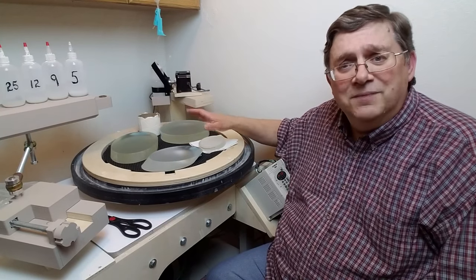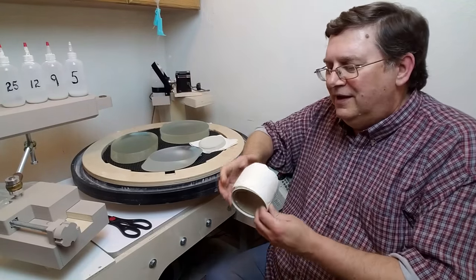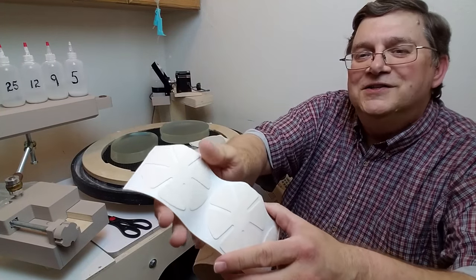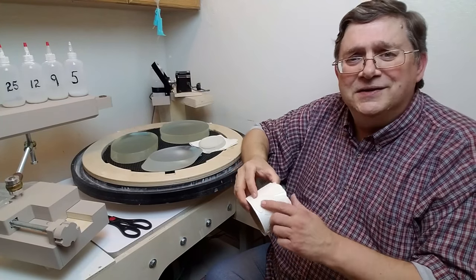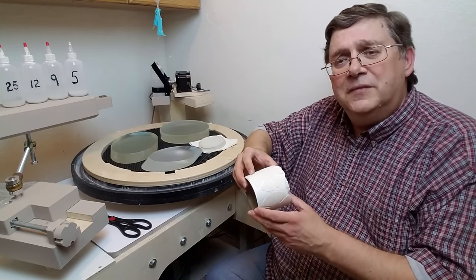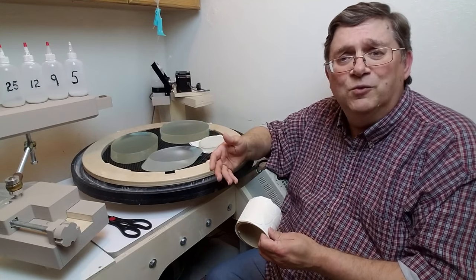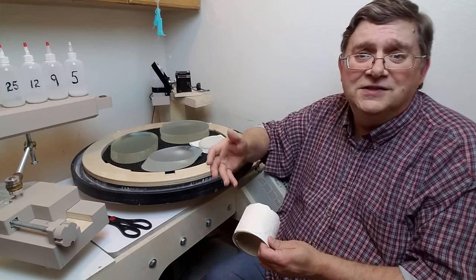But before I do that, I want to make those backs transparent. To do that, I use polishing pads. Normally in a good optical shop you don't find polishing pads being used very much — they're a synthetic material, sort of in the same line as the felt that opticians used to use for polishing. Basically you stick them on a flat surface, then use normal cerium oxide with water and polish on that flat surface instead of using pitch.